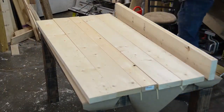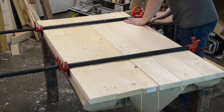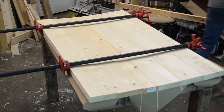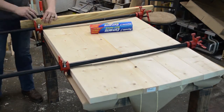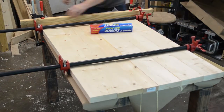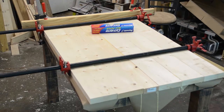After the boards were cut, it was time for glue-up — getting everything nicely clamped down. I had a little more bow than I really wanted, so I threw some side supports down and clamped it to the table, which actually made for a custom fit. You'll also see me putting wax paper not only under the board but under the pipe clamps as well, because glue can react with the metal and leach color into the wood.